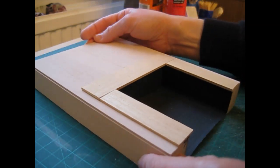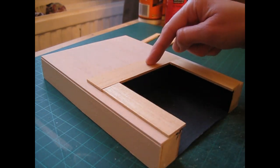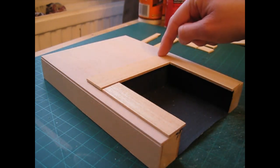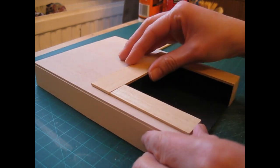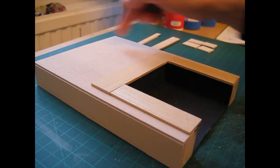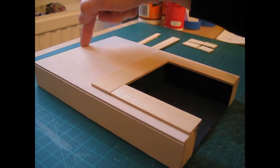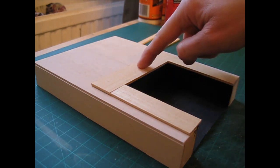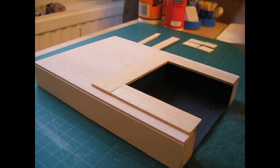For the width I worked it out so that I had a nice border along each side. As a guide, the top piece is 115 millimeters wide by 27 millimeters high — that's four and a half inches by one and one sixteenth. The height is really just what looks good. I initially did this a little thinner but it didn't look right. If you do the graph paper layout I suggested, including the chimney breast height, you can work out what looks good. That 27 millimeters — one and one sixteenth of an inch — is a nice height above the opening.